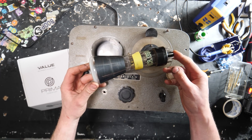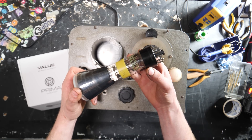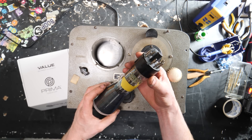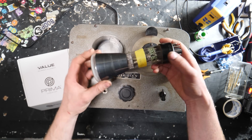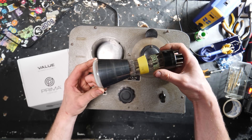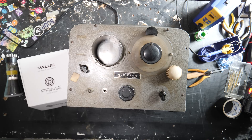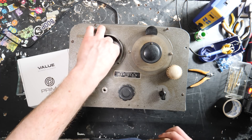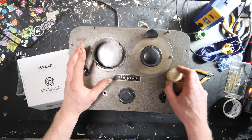The first thing I looked at doing was replacing the CRT. This is the one that was in it and as you can see the back of it is all wobbling. It might have been easy to fix, but it turns out searching up the VCR139AU, I managed to find a replacement and it still seems like a plentiful stock of it for about £15 for a new CRT. I figured it's worth a risk, let's see if we can get it to work. So I replaced it and it started working, and at that point is when I did this video.